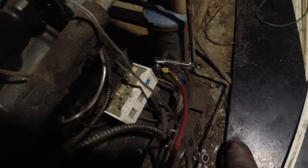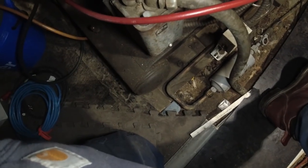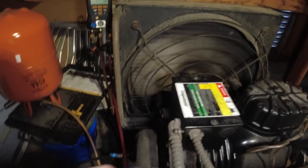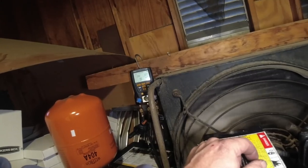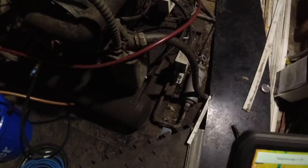All right, so we valved it off. We're waiting for it to pump down. We'll make sure this thing shuts off. We'll see where that level is in these receivers we got underneath here. You got a receiver there, one over there. So they're really good size. See where this thing shuts off at. I would think now would be good. It's at 1 pound. Wow. Actually shuts off. All right, good. So let's see what we got for receiver level.